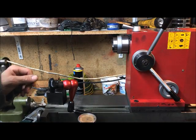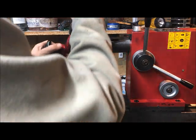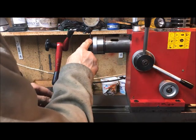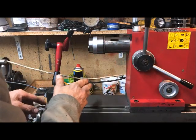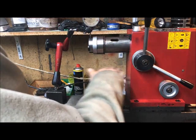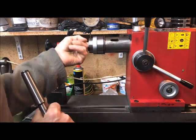And then the spindle measurements. We can do a locked-up quill here and measure the outer roundness - both in the taper and here with the test bar - and also how the spindle is situated with the axis in that plane and in that plane. First rule: I have a test bar and I need to measure here and line the center there.